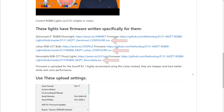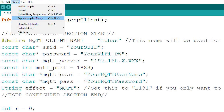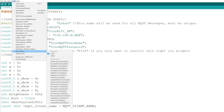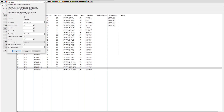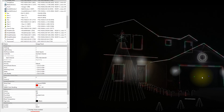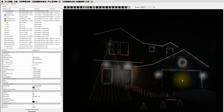I have the firmware for each of these devices on my GitHub page, so just download the INO file for the correct product, update the user configuration section of that program with your network's information, use these options for the board, and select Sketch > Export Compiled Binary. This will generate a .bin file in the sketches directory that you can use to upload to your device from the Tasmota web UI. If you need to change any information later on or want to go back to Tasmota, my files do have Arduino OTA updating enabled, so they'll show up on your list of ports in Arduino. To add them in Xlights, you'll first define them as their own E1.31 controller using unicast and put in the IP address of the specific bulb. I've put them all in their own universe with only 4 channels, which simplifies using a single LED defined as 4-channel RGBW with an increased radius and transparency to represent the model of your floodlight, downlight, or light bulb in your preview window.